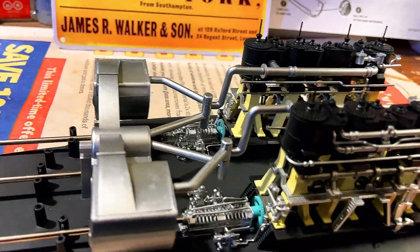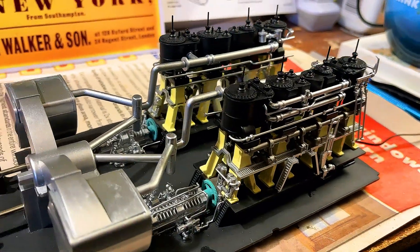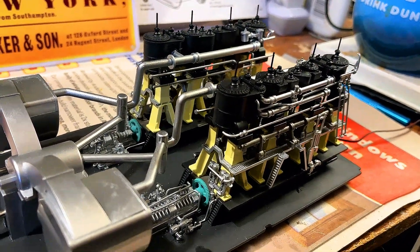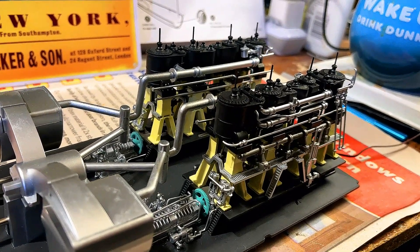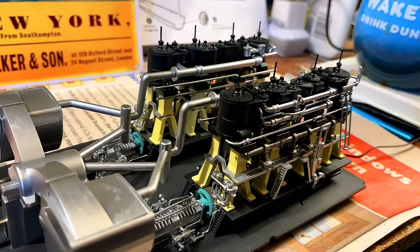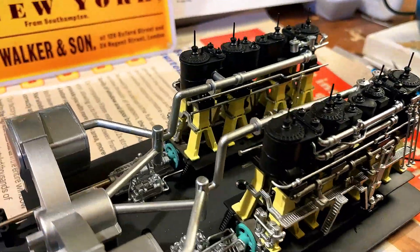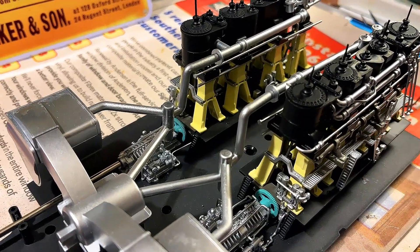So I'll put it on for you. You can see it's running pretty well. There's still a little line from the motor and the gears. I'll put up the video I did last time — you could hear a click. I didn't like that sound. So like I said, I adjusted the thrust blocks and that made it run a lot smoother.